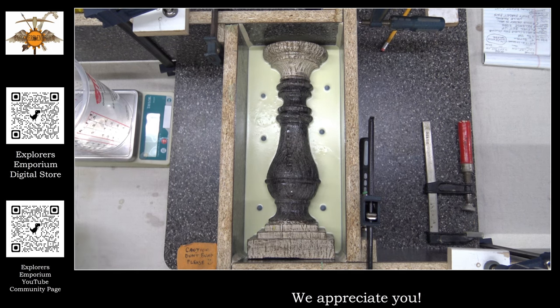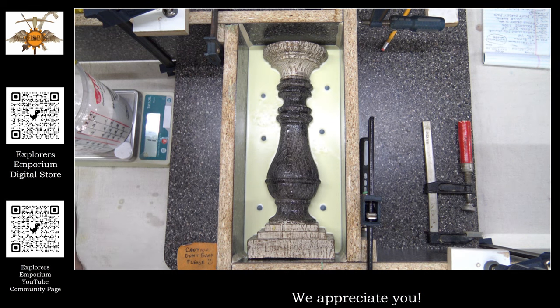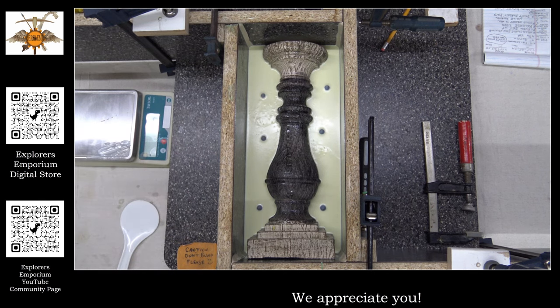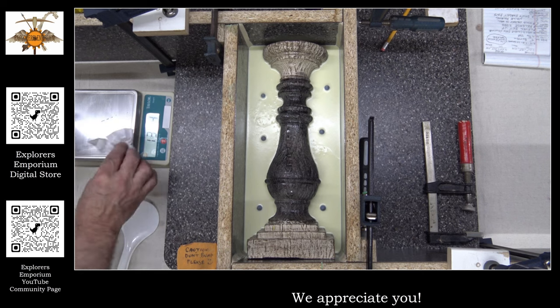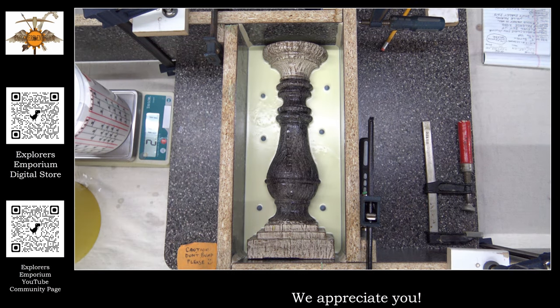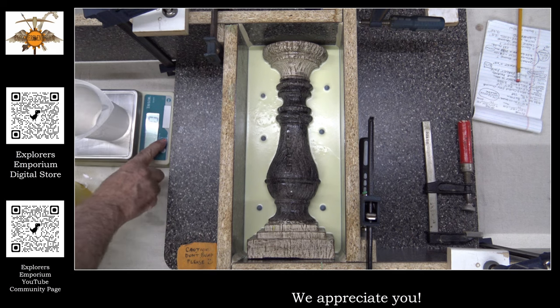This time I won't have to use smaller cups — just a larger bucket. It'll still take about one and a half buckets to finish the pouring process. As I get the bucket filled, I'm going to bring that weight up to 2,171 grams. And did you see that spoon? That's actually a rice serving spoon — but what an ideal tool for scraping a bucket during this process. Then we'll do part B at about 218 grams and mix those two together.